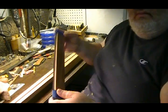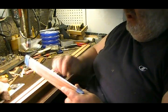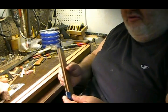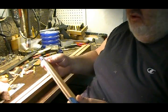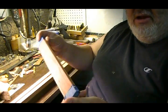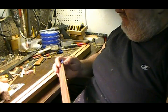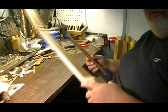Now, to do this kind of work I have put together an ingenious little device that uses your standard 16-inch planer blades. I have a thickness planer that runs on a blade system — a three-bladed thickness planer. When the blades get too dull for the thickness planer, I'll put them on my wet stone, sharpen them back up, and mount them in a wooden handle so I can use them as a scraper or a spoke shave. Spoke shaves are a little pricey, and if I can make the tool myself, why go out and buy one?